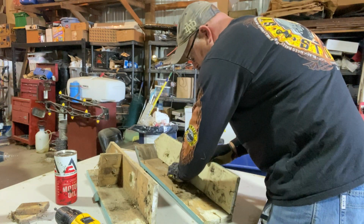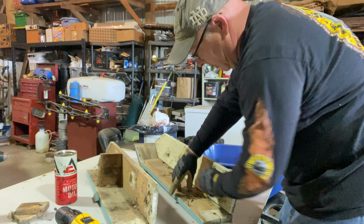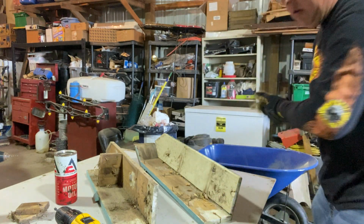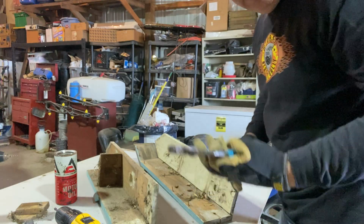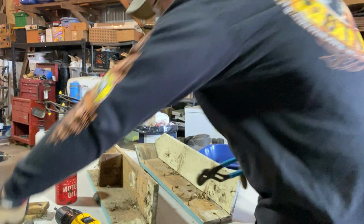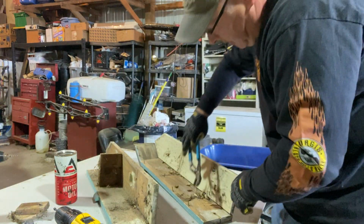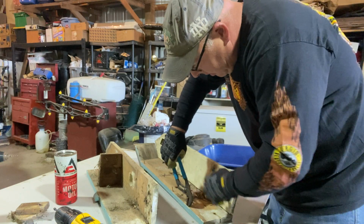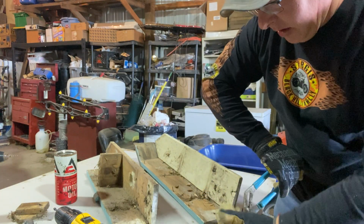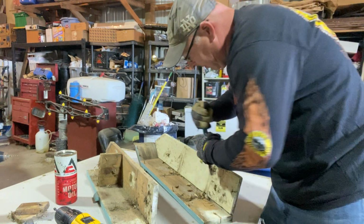Get most of the leaves out here, and as you can see, there's finish nails still in there yet. Now, the easiest way to get rid of finish nails is with pliers. Either slip joint, or sometimes I like to use the fencing pliers as well. You can't really pound them back out because they just bend. So you get a hold of them here, and out they come.